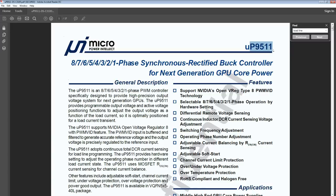There are 1060s out there that use the UP9511. Below that you don't see the UP9511 very much, because there's a UP9509 or similar — that thing is a 3- or 4-phase controller, and it's much cheaper. This 8-phase controller is extremely common on 1060s, 1070s, 1080s, 1080 Ti's, and 1070 Ti's as well. And it is completely analog.